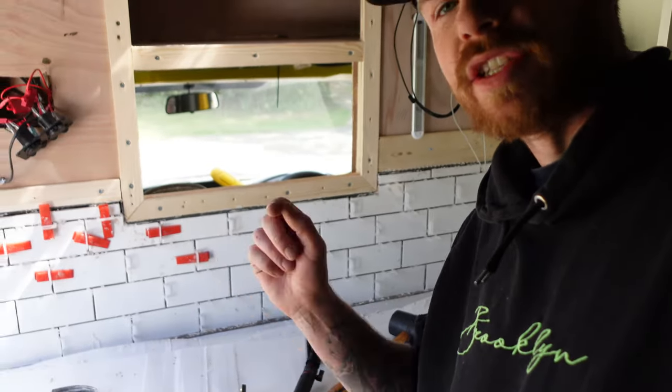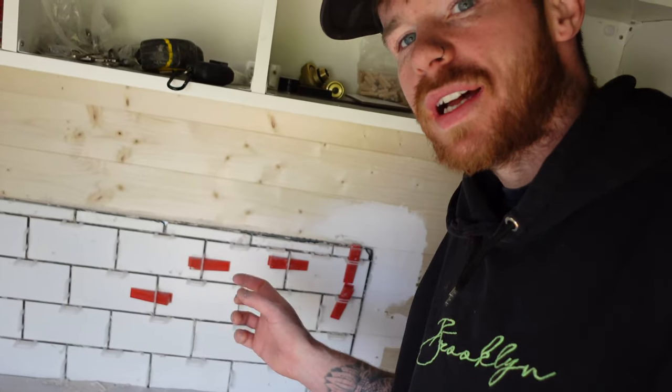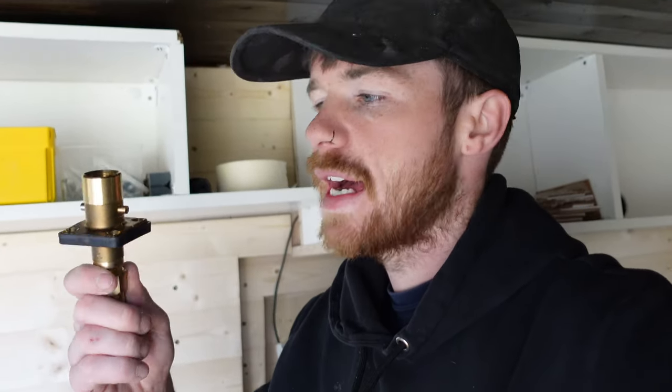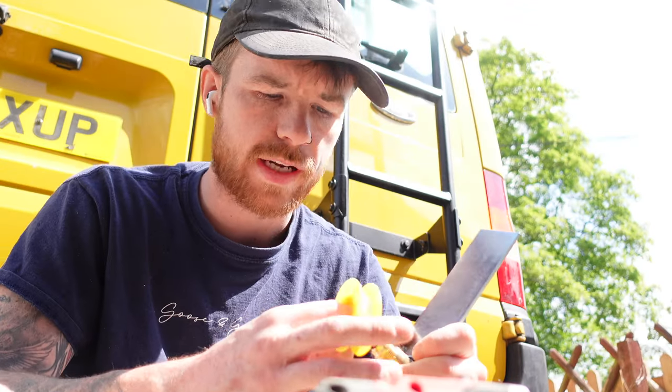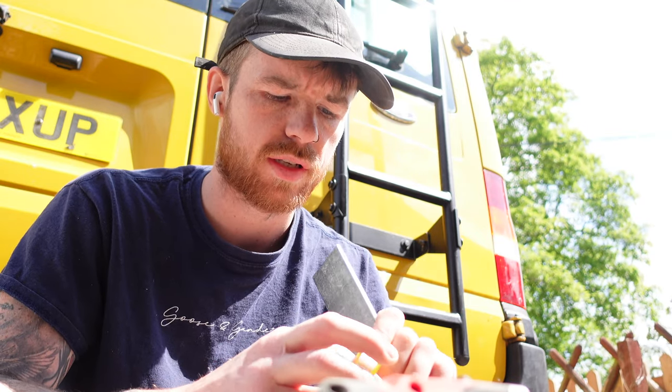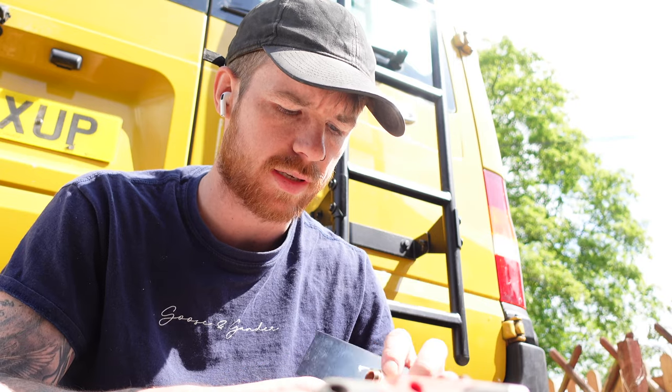Good morning - little tile update. Taking all the wedges out but the adhesive still hasn't quite set off yet, so some parts are still a little bit wobbly, making me doubt it all. We'll give it a few more hours before we try and grout. For now, we have the correct fill valve for the tank that we installed last episode. So we're going to complete the gas installation - attach the fill valve to the tank. We're going to wrap some gas PTFE around the threads to seal them, make sure there's no leaks. We've already tested the rest of the system and there are no leaks.